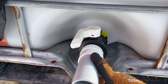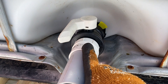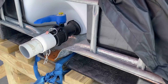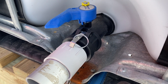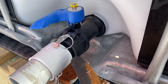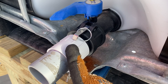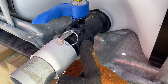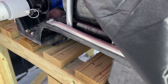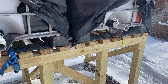Something to keep in mind: not all connections on the totes are the same. The first tote I got had a fine-thread connector and I assumed they'd all be that way, so I got three threaded couplers. Then I got to the second one and it was a coarser thread. I ordered bulkhead couplers and that turned out not to be what they were either. I finally gave up and went with cam-lock to fine-thread fittings. In hindsight I could have used those for all three and been consistent, but we are now good to go with connecting the three tanks.